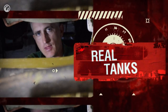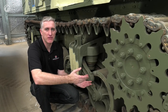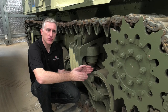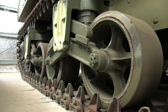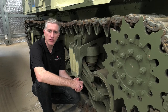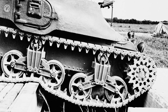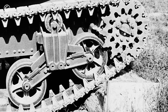Continuing around the side, the running gear was basically held over from the M2 medium, which was a factor in quickly ramping up production. These are the old-fashioned vertical volute bogeys — two wheels per bogey, bolted simply onto the hull. The advantage with the bolted design is that replacements were very easy: if you had damage to the bogey system, you just unbolted it and put a new one back in. Another advantage was that it took up no space inside the hull, unlike suspension systems such as Christie.